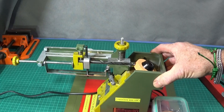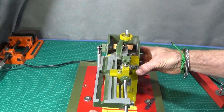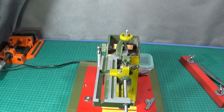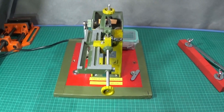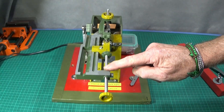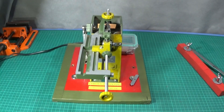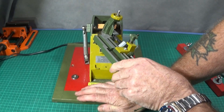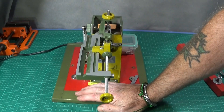It's a very clever design. I've got a new wheel on here so it's ready to start up — I don't need to dress that wheel. What I'm going to do is move the screw forward until the drill just touches the wheel and then do the grinding motion like that. I'm going to remember exactly where this one ends up when I've finished the first side.